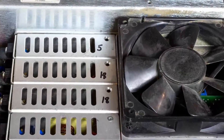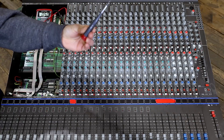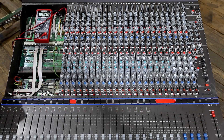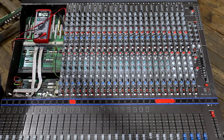So when that voltage is sufficiently below 5 volts, the whole system malfunctions. Back over at the power supply, you have adjustments for the different voltages, and just using a small screwdriver I was able to tune the voltage for all the rails. They were all just a little bit off, so now everything's in check and it looks like this desk is in better shape than I originally was thinking.